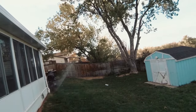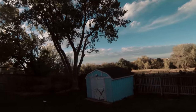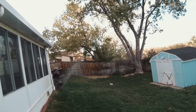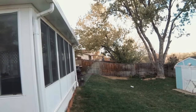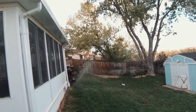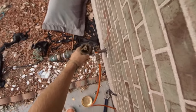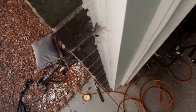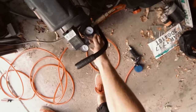That's the sound you start to hear — air coming out. We're supposed to get four to seven inches of snow tonight, 30 degrees, and then tomorrow night it's going to be 20 degrees. This compressor is actually big enough because it's blowing it all out nicely. With my neighbor's smaller one I had to reset it, lose pressure, turn it off and build pressure back up. I looked it up — it says 50 to 80 psi; if you have PVC, 80 psi. I was doing it at 100 — hope I didn't break something.